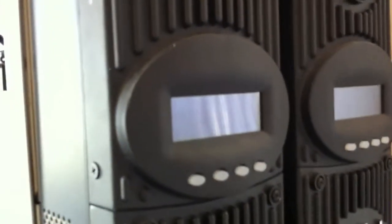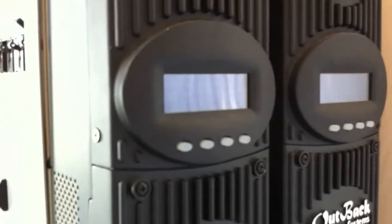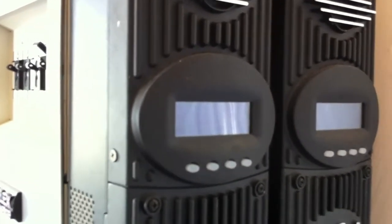Is there a way to check the battery charge from here? This output voltage is a good indication of state of charge — it's at 54. If you see this ever drop below 48, your batteries are being discharged. What should this be? 54. If you put a real load on them it'll drop down. If there's no load and it's the middle of the day and it says 47 volts or anything below 48, that's an indication your batteries have not fully charged.